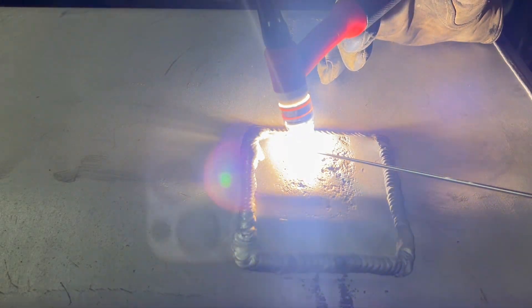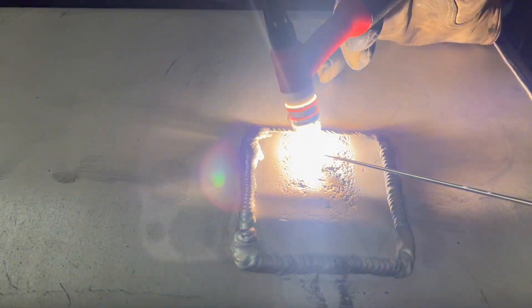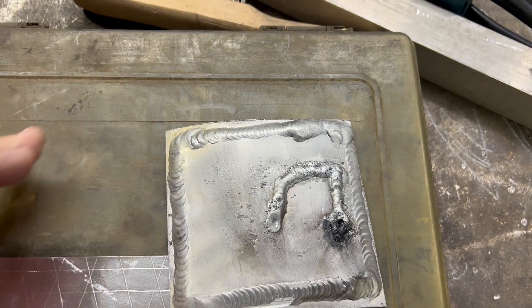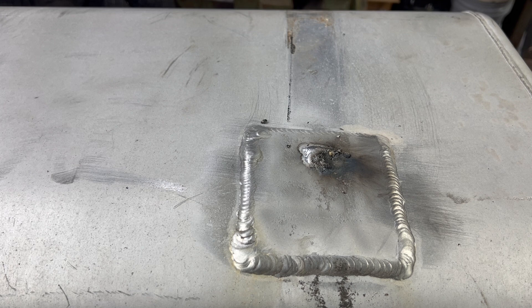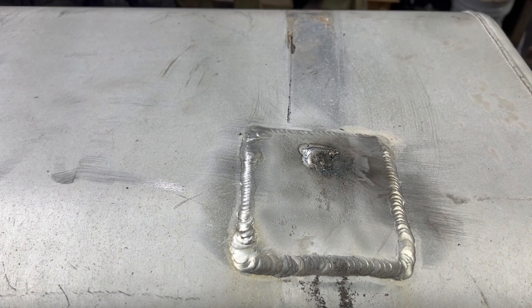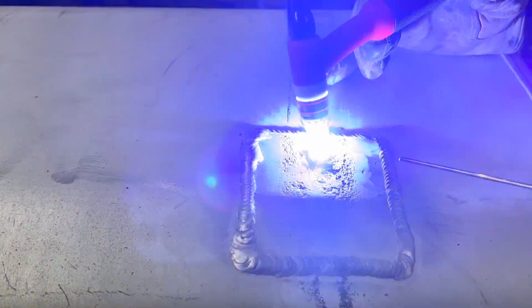Here I'm starting to weld on this tank and between the patch and the original tank there's already a hairline crack. As I light up on the area that was almost gone through, it blows through and stuff keeps blowing back at me. Whoever used this diesel tank before either mixed some gasoline in or used some really nasty anti-gel because that stuff was burning pretty hot - that doesn't usually happen on a diesel tank. That's when I decided to go ahead and wash it out like it should have been done first. Even purging didn't help; gases were collecting between the patch and the tank and igniting over and over.